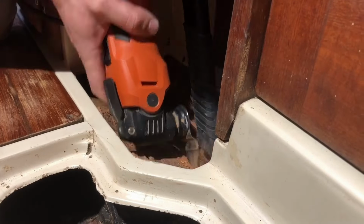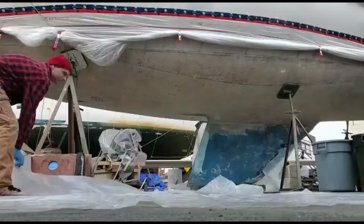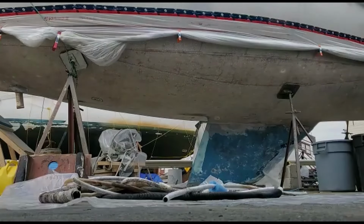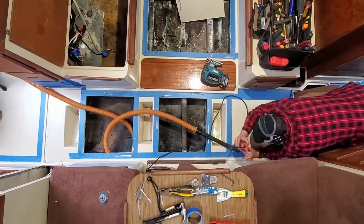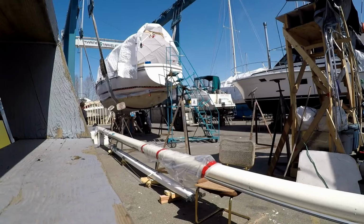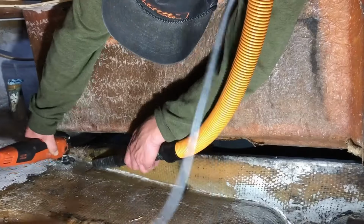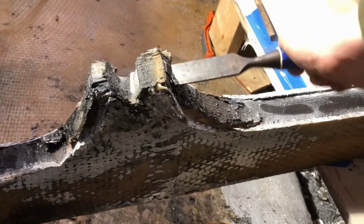The mast step was next, as was the dreaded job of removing the holding tank. And can't forget the fuel tank, which we had to empty first. All of the plumbing would be coming out. To fully expose and clean the oil-covered hull and rotten stringers, we had to cut the floor out and remove the keel. Alas, we would build a cradle to be able to remove all of the stringers at once, as they were all soaked to the very core.